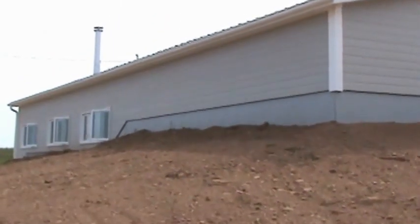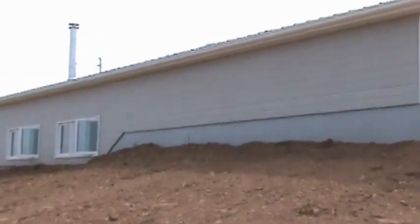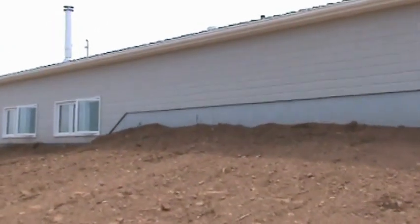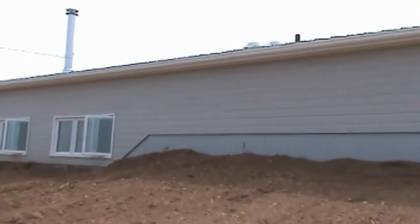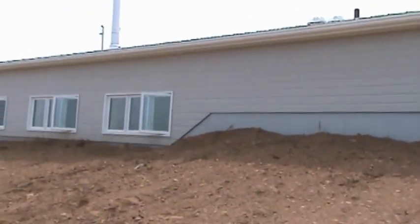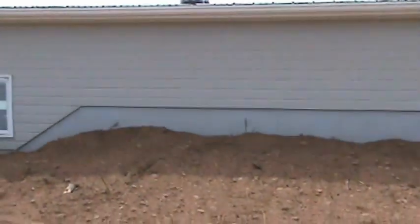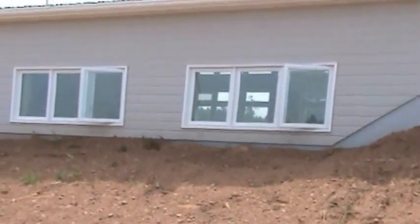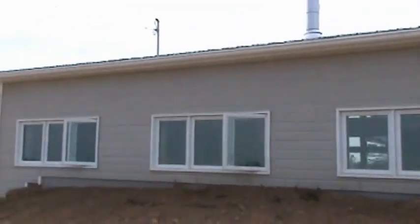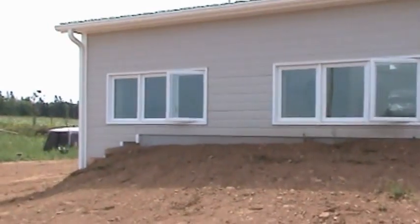This is the back side of the house and we've got a few north facing windows we needed for ventilation. Also one is a bedroom, so we were required by law to have a certain size window, and for symmetry we did the other two the exact same size. It's all bermed up — at least half the wall on the north side — which again gives it cooler temperatures in the summer and warmer in the winter.